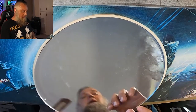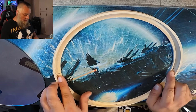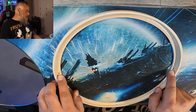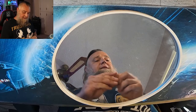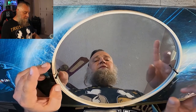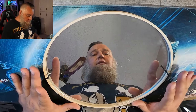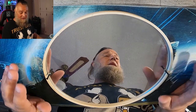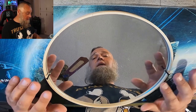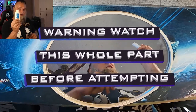Let's take a look at the back frame. I was able to use the same design as the front frame — the only difference is on these holes I cut them all the way down. The mirror piece just fits in there, and when these screws go in, you screw them in just enough so a little bit is sticking out. The reason for that is so you can put a wire through so this will be able to hang. It's all dusty with fingerprints and scratches — that's my bad. I was hot and tired and grabbed a paper towel to clean it off and got a bunch of scratches.